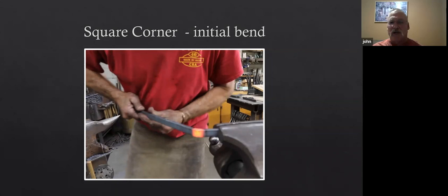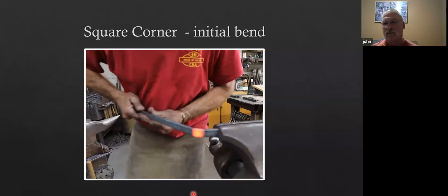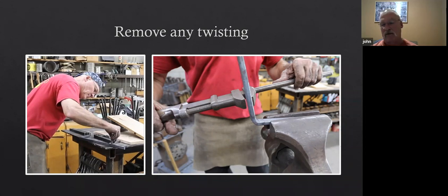The upset square corner is made with a nice local heat. If you don't have a torch, you're quenching and spending a lot of time dealing with that. You make your first bend and then I always check to make sure the two parts are still 90 degrees to each other. If they're not, fix it now before you get too far. If I think they're going crooked again as I'm working it, I'll stop and get them back on the same plane.